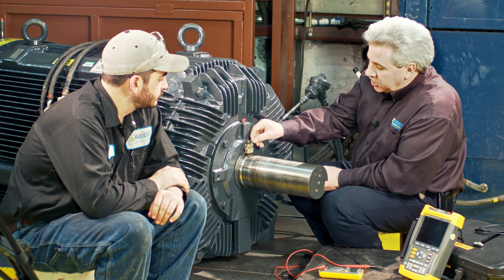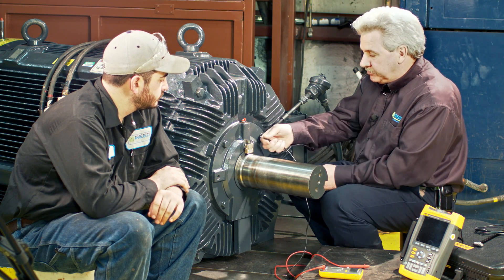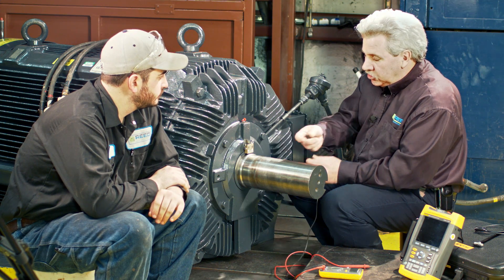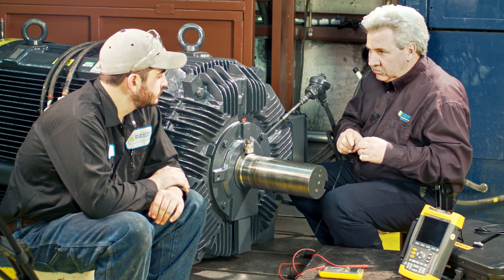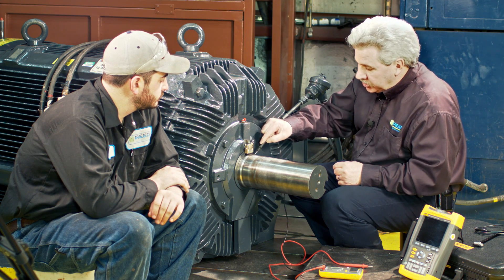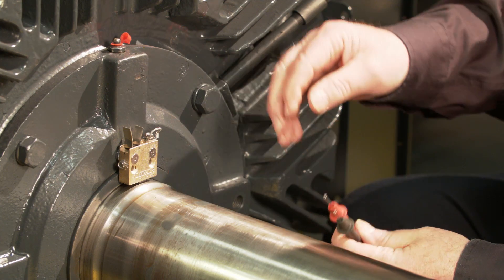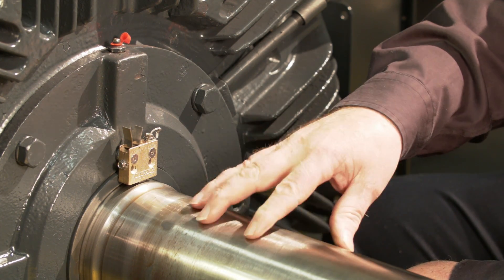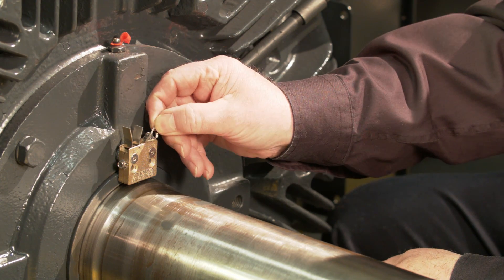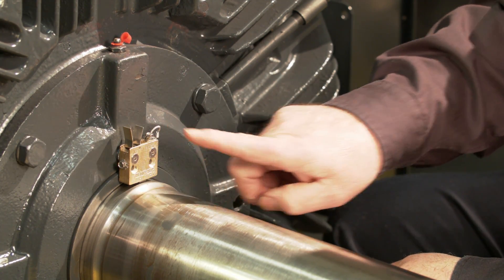You can mount it directly to a brush and use an alligator clamp onto the end so it's making a nice path. You could solder one on it, keep it in a toolbox. But you still want to check with that brush touching to ground to make sure that you have a zero reading during the test. I have seen these come in from a power plant that were mounted on by us and that pigtail had turned blue and melted off — so the current was pretty substantial for that to pass through.